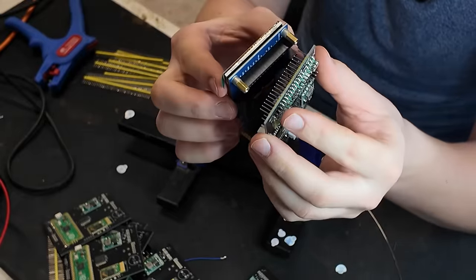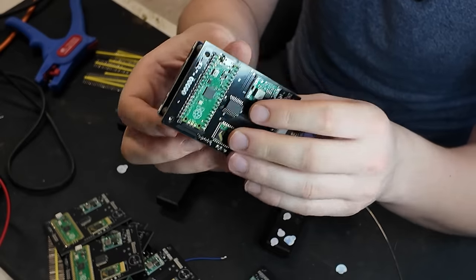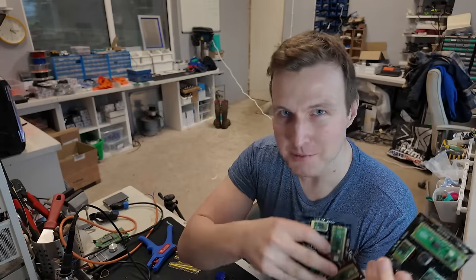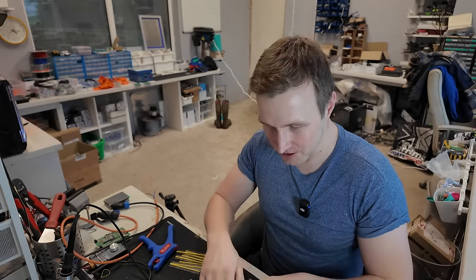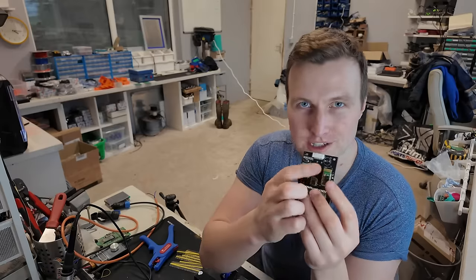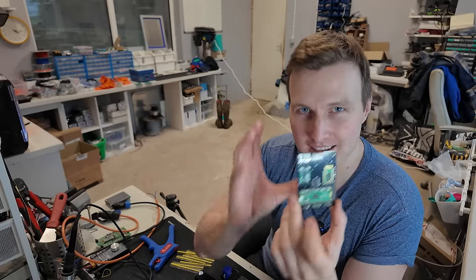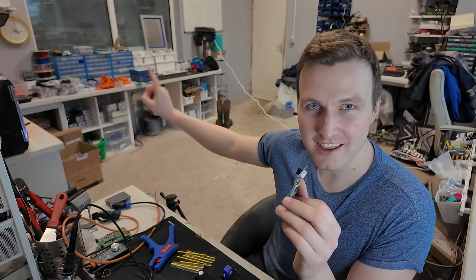The screen simply attaches on the pins — this is a three and a half inch touchscreen LCD — and that is it all connected together. I am going to finish soldering the rest of these PCBs, I find this job very relaxing and quite enjoyable, and I'll be done in about 40 minutes. We will get the Bluetooth chips programmed — we have to do that before we put the screens on — then add the screens, upload the code, get the touchscreen interface working, and then we are ready to stick them into the plastic orange cases.